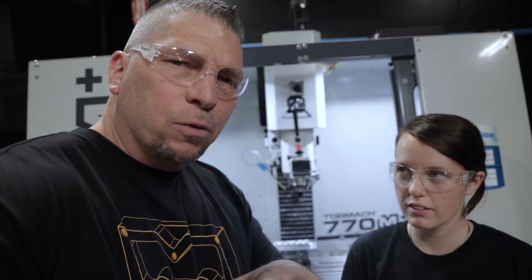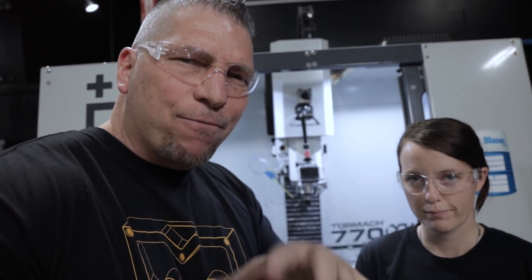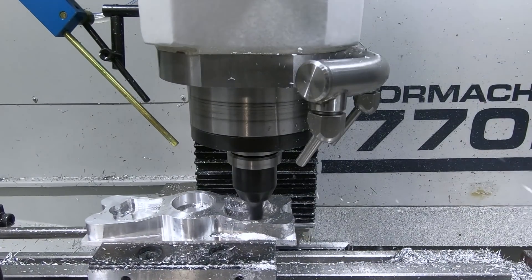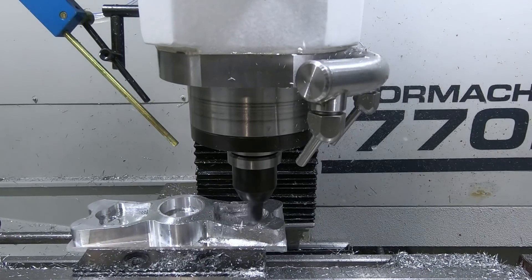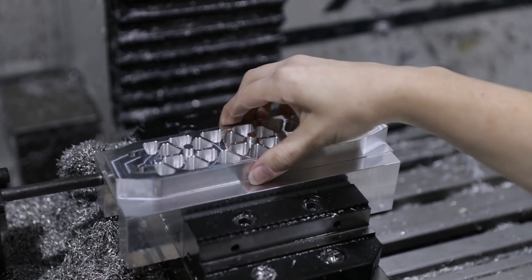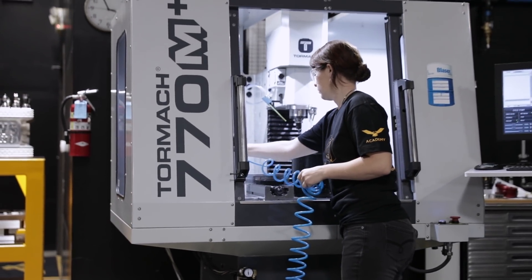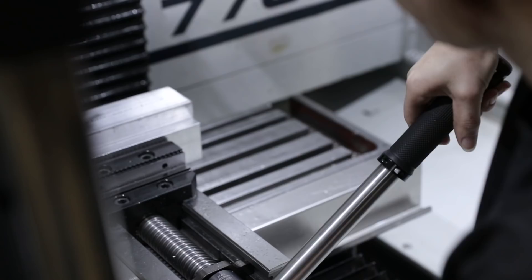Most of the programs out there when you start out on the building blocks, we program about 4,000 RPMs, and then later on in the CNC video we kick it up and show the difference in time. But a lot of schools actually have smaller machines that don't have the horsepower and the RPMs. This particular Tormach has a horsepower of 1.5, so we just have to back off, slow down, take it easy - and you can actually make incredible parts.